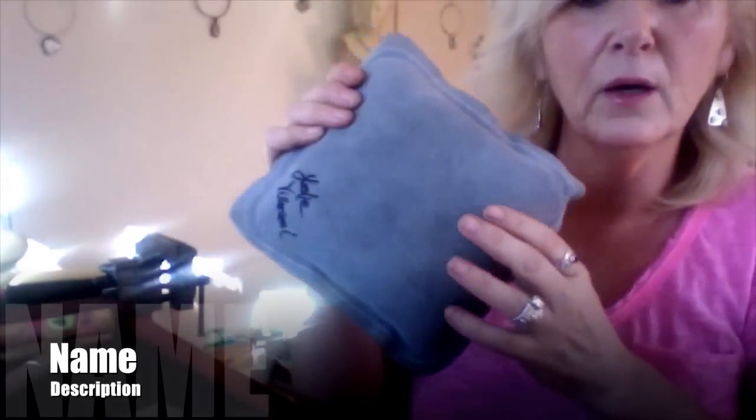Another thing that you should have when you're starting out is a pillow. The pillow is meant to lay your steel block on top of, like this, and it absorbs the sound when you're hitting. But I don't really use mine for that. What I do use it for is repoussé work. So in chasing and repoussé, you can lay a sheet of metal and you can start forming it. I use it in place of a pitch bowl. And a pitch bowl is a bowl full of a substance that allows your metal to take form and shape on the back. Whereas if I hammer on a piece of steel, the back is going to be whatever shape is on the back of the steel. It's going to be flat.